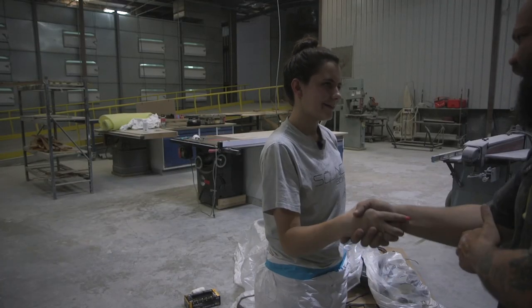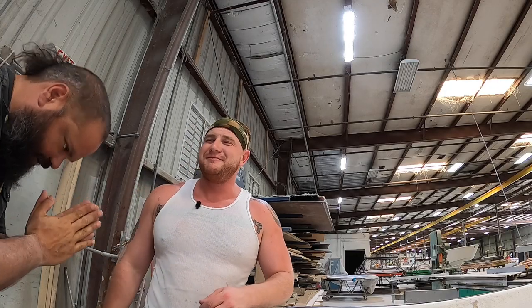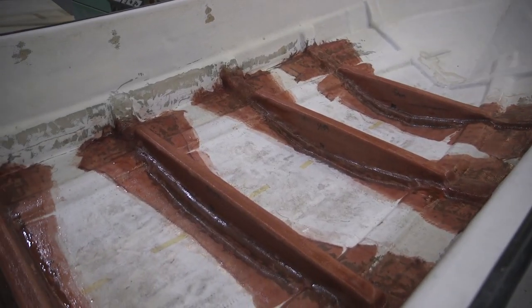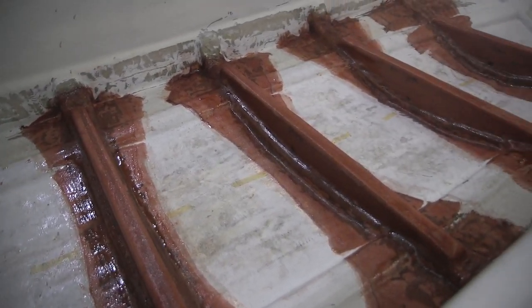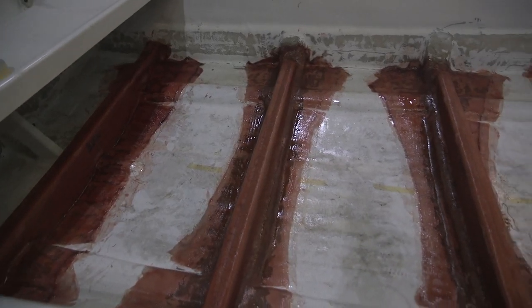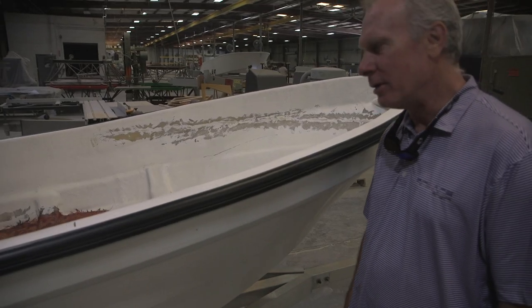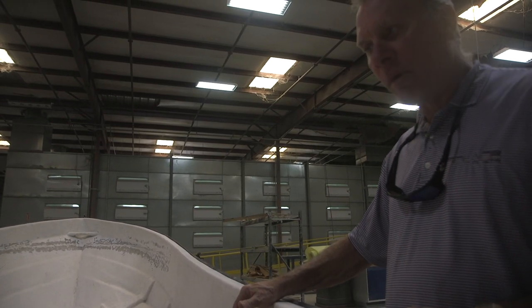This is just the rollout to make sure it stays strong and get the big air pockets out of it. If there's air pockets underneath, water gets into your hull — it'll slowly make its way under the glass and lift it up, so that's why we roll it out. It'll probably be completely hardened in about an hour. These guys did all the work, so of course it seems way easier — I was expecting this to be quite an ordeal, but they got everything prepped and just busted it out. We're like 15 minutes deep on this.